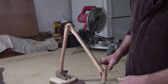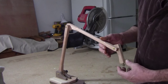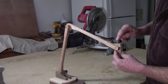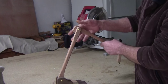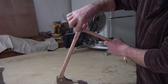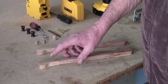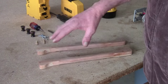I noticed a flaw — when I tighten this down I have to tighten it really tight because the 400-sanded surfaces are too smooth to hold. I'm going to add a piece of cherry wood about three-quarter inches high on each side, and then put a pin through it so the arm can be locked in different positions. Everything's been gone over with a 220, and now I'm going to hand sand the whole thing with a 220, then go to a 400.